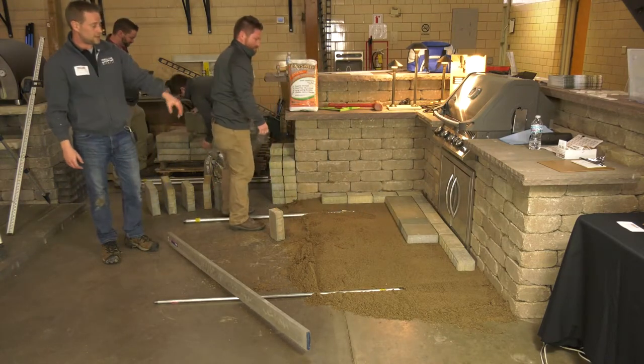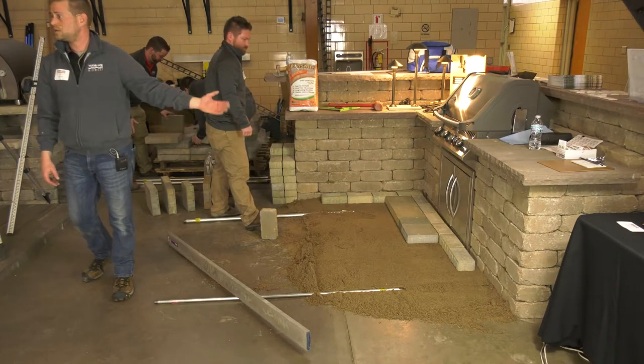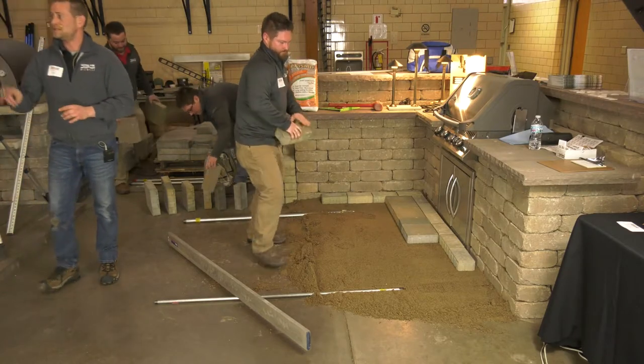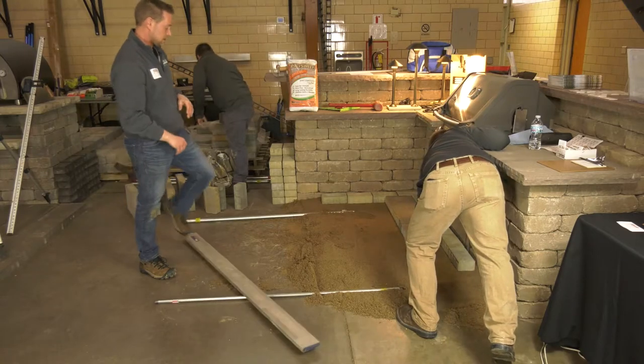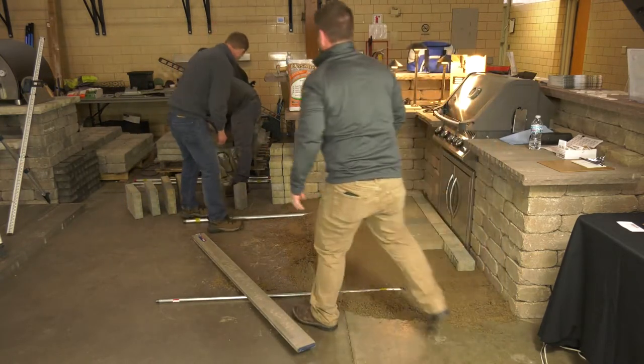So you can see what they've done here is we've gotten one large paver, a square, a Twinkie. We'll do a square and then another Twinkie, right? And that's basically one set when we're doing our running bond pattern with these pavers. Get a large guy here.